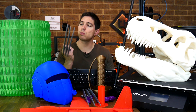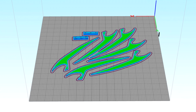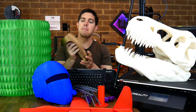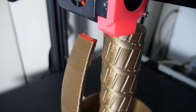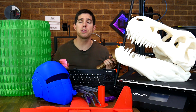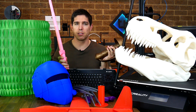Next up I tested these Wolverine claws — they turned out pretty good, and I did them on this printer just to show how easily things fit on this bed that might need to be split into multiple print jobs on other printers. The 0.8mm nozzle is not really well suited to it, but it still got the job done. Next, I tried this massively scaled up extendable pirate sword. In my slicing profile, I didn't have the retractions tuned, and the resulting lump fused the pieces together. It's such a shame, because I'd printed these before and they're meant to be extendable — on a sword this big, that would have been absolutely epic.